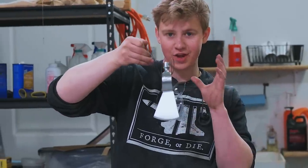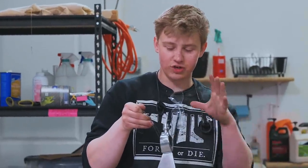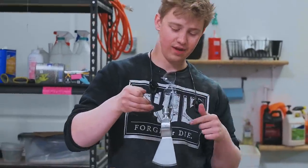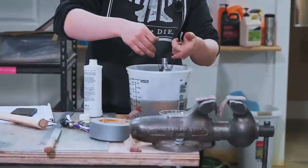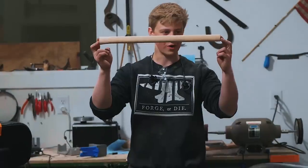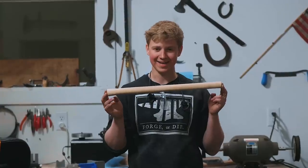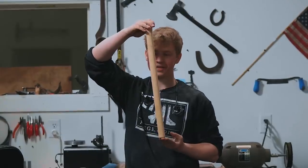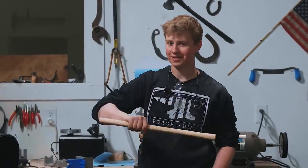The head has been neutralized. I'm going to dip it in the acid really quick — make sure that there's no oil spots on there that aren't going to etch properly. Then I'll dip it in and we'll let it sit in there for about 35 minutes or so. Now that the tomahawk head is in the acid, we're going to give this thing a little burn and then seal it with some pine tar.